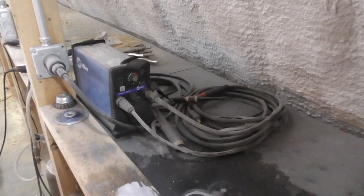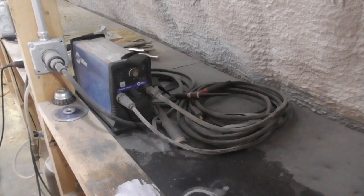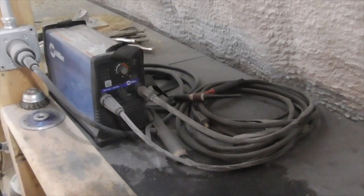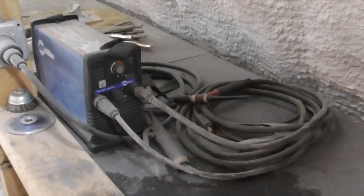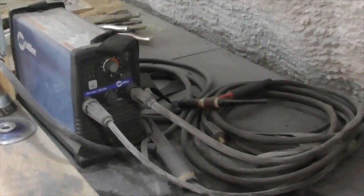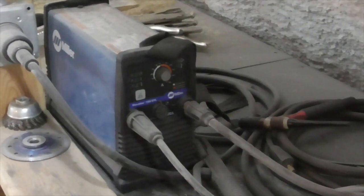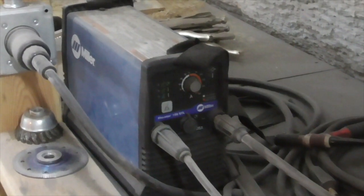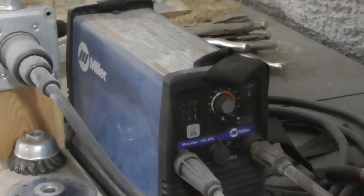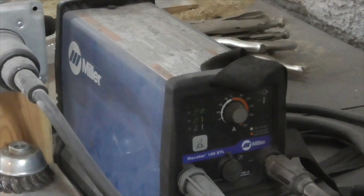A welder allows you to join metal parts together, building up complex parts from simpler component parts. However, welding is a unique skill that takes some practice to master, and a good welder can be one of your more expensive tools. There are different types of welders, but for gun building or any kind of metalworking that requires a degree of precision, I prefer a TIG or GTAW welder, which uses a tungsten electrode and an inert shielding gas such as argon. Here I'm running a Miller Maxstar 150, which can be used either as a TIG welder for precision work or with consumable stick electrodes for other projects like building a utility trailer or welding up a metal frame to hang steel targets on. For what I do, the Maxstar 150 has been a really good fit, but I'll concede that there might be cheaper welders out there that would still provide objectively similar capabilities.